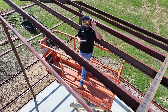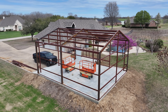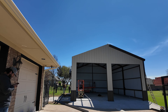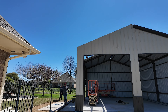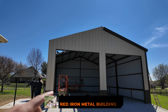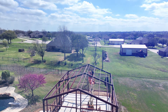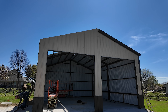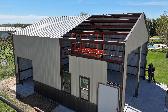Check this out — this is a 30-wide metal building. Say hi to Roy! We're out here doing a checkup on this project. It's 30 wide and 36 long with 14-foot eaves. It actually has a 4/12 pitch — our standard is 3/12 but the client wanted a bit more of a peak. We've got two doors: 12 by 12s on the front and an 8 by 8 on the side.